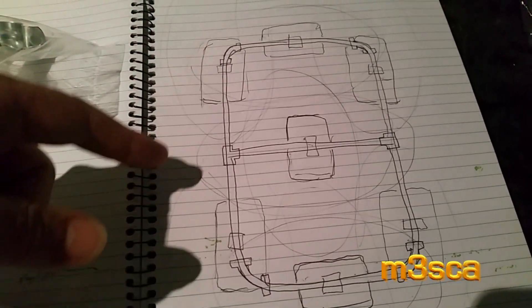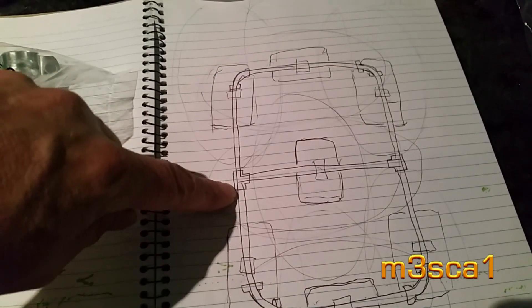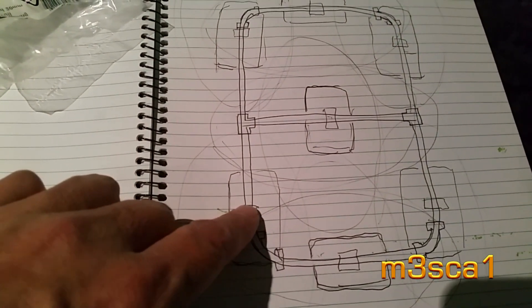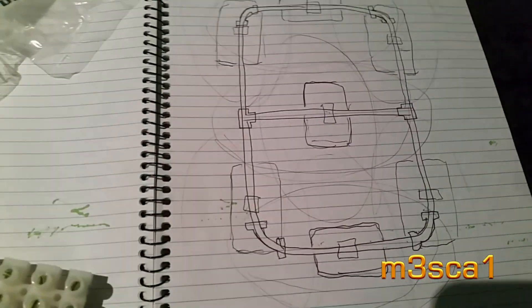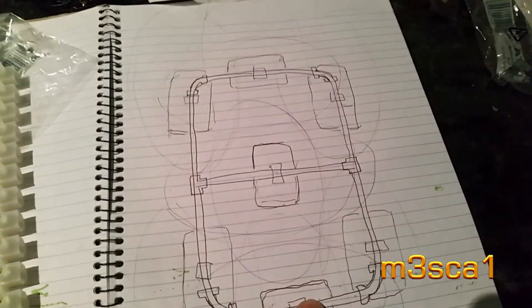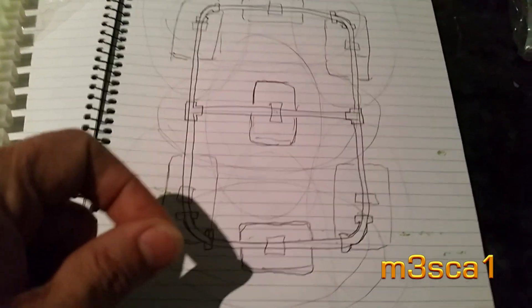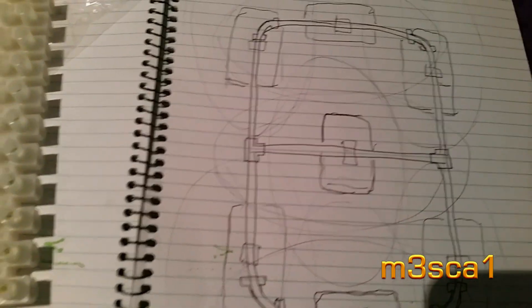Here's the plan: big COB LED light, I'm going to use electrical conduit and conduit connector fittings to make the frame, with little conduit saddles and silicon adhesive over the back of each panel. I'm thinking about putting pulse width modulation control on — I have the electronics to do this — and that would give me really powerful color temperature control by adjusting how much power goes to each one.